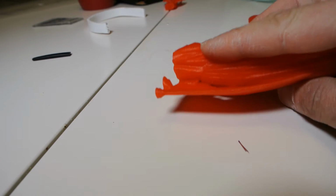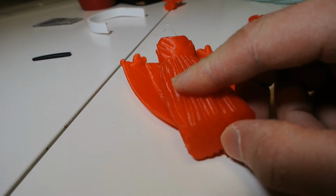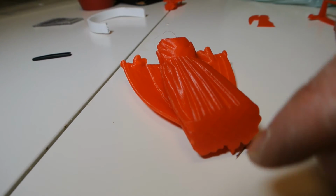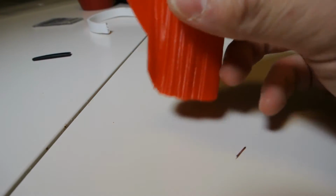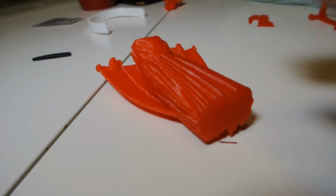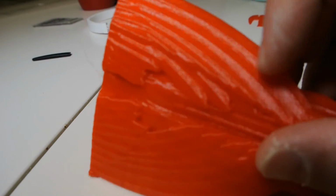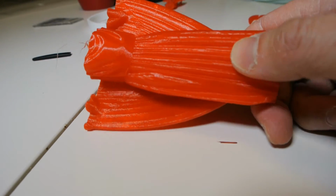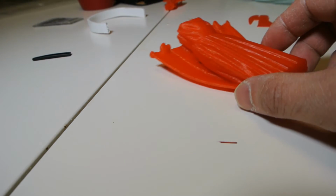But this here is the Weeping Angel that I mentioned earlier, and it fell over. Like I said, there's another video on my channel where you can see a time lapse of it falling over. What happened was this detached because the base was rocking back and forth, and because it was getting tall and this bottom part was small, it fell over. But as you can see, this was printed at 0.1, and it's really good. It's really smooth. So the printer can do a really good job so far.